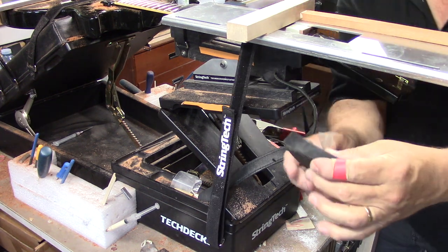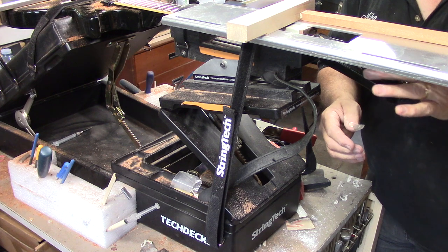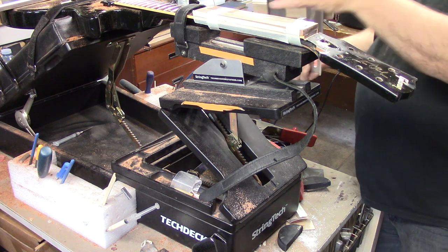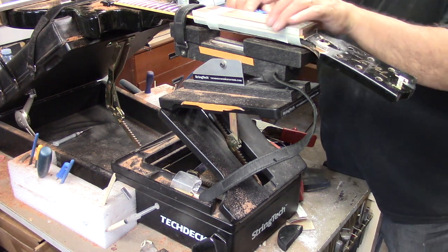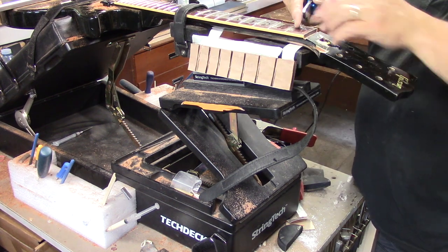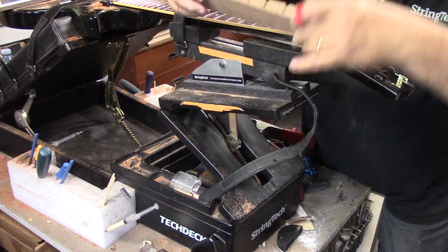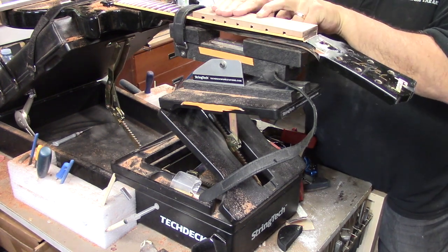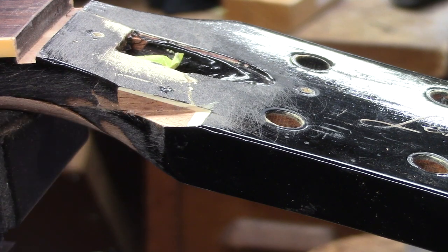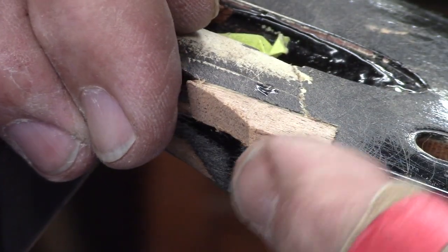This flat surface of the hockey puck rested on the angled headstock — I pushed it up under the plate until the plate was supported, then put a slip of double-sided tape on here. It might seem like overkill, but if you had to program a CNC machine you'd spend days trying to duplicate what I just did. I basically cut a curved surface on the bottom and cut out relief cuts for the frets, and that gave me a flat surface to put my plate on. This is the right-angle cut we went to all that trouble setting up, to make our little mahogany filler piece.